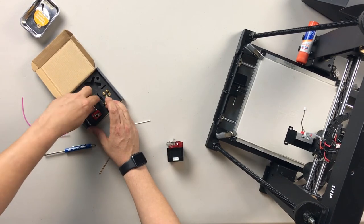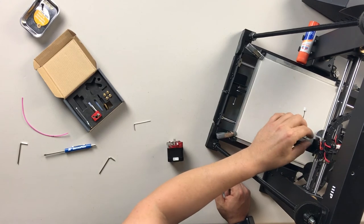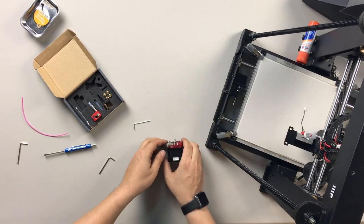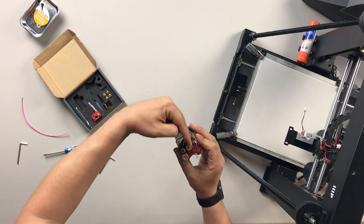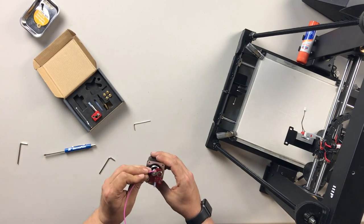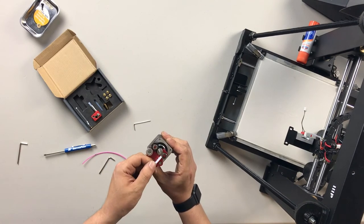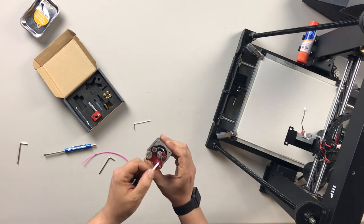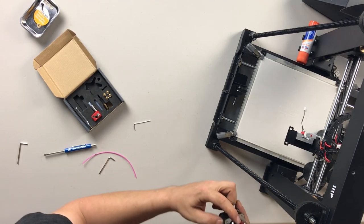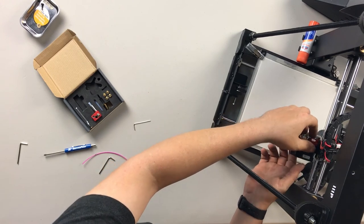Pull out the filament and you'll notice there's a piece of PTFE tubing already in the heat break. Make sure that the tip on it is facing side to side — so when it slides up into the hole, it's sitting where the two circles meet. You don't want it sitting straight up because it'll just grind up on those circles; you want it sitting sideways so it sits down in there closer. Same thing with the bottom. So sit that tube right on top of this hole right here and it goes on there just like that.